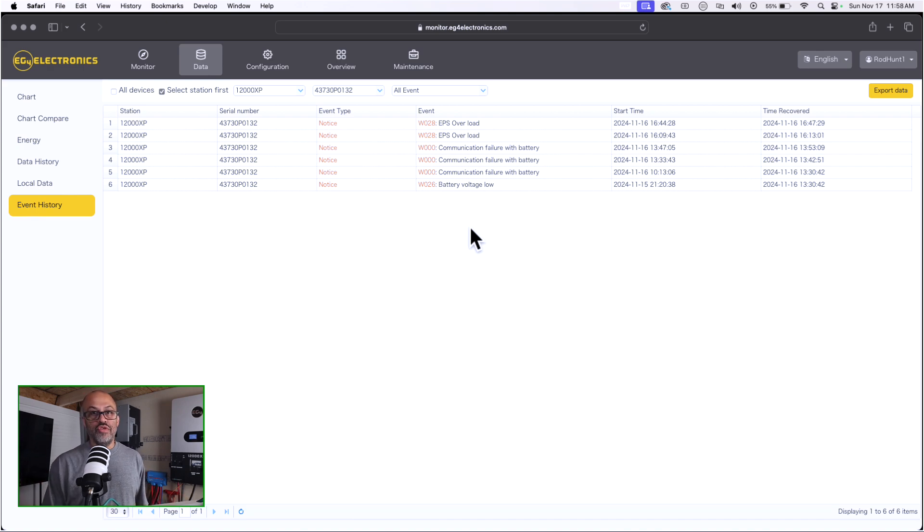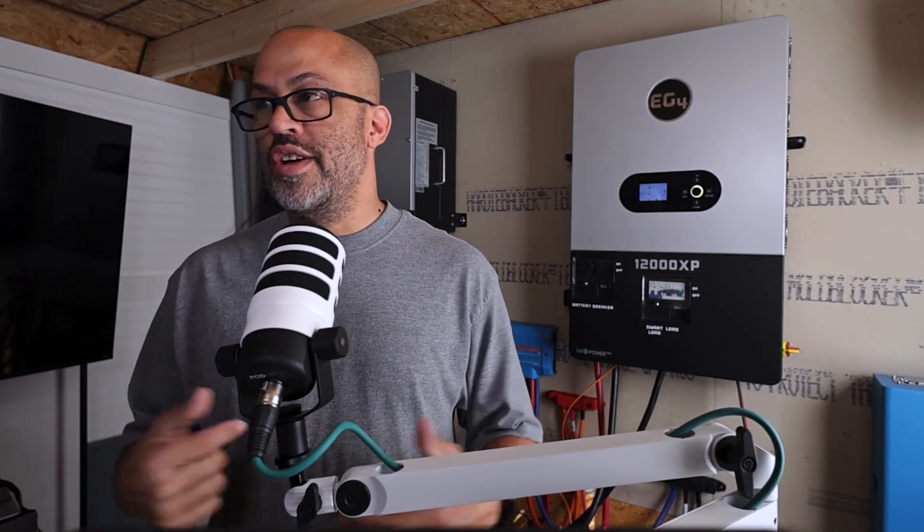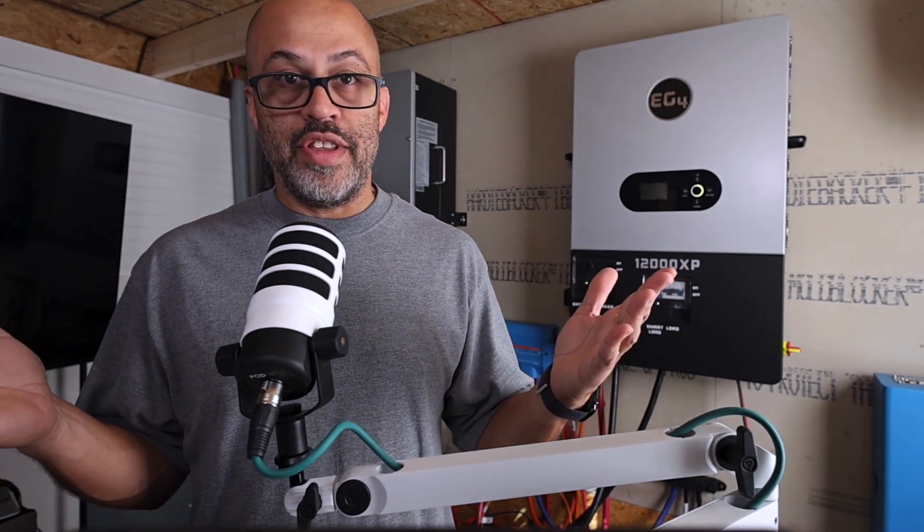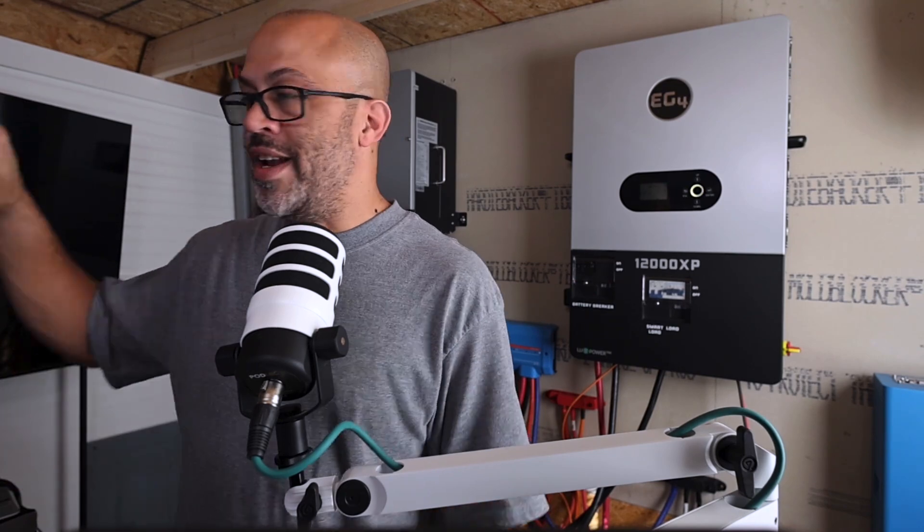I don't want to run this stuff too long on one leg the way I have it set up with a 20-amp breaker — way too much coming through there, just for testing purposes. So what do you guys think about this leg imbalance test? It's definitely going to be able to do 6000 to 6500 watts. Above 6700 watts after about 10 seconds, as you saw, it was kicking out. That's probably just how the parameters are set on the inverter. Hopefully this clears up the confusion from my other video. I had other stuff hooked up and didn't turn the right breakers off — just didn't have it set up right, that was my fault.